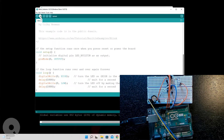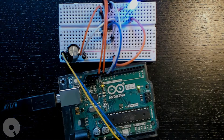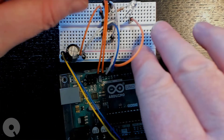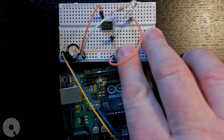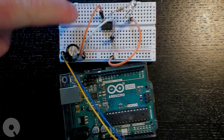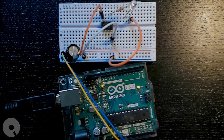Upload that and see what happens. I had my LED backwards, but once corrected you can see the blink working just as expected, all running off the ATtiny85. I'll unplug the Arduino — which removes power to the ATtiny85 — and disconnect the programming wires, leaving only power and ground. When I power the ATtiny85 back up, it runs its blink cycle on its own. Easy and breezy!